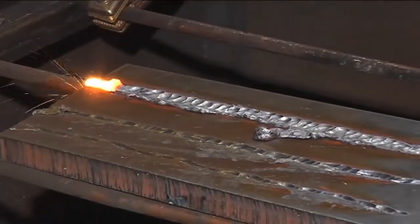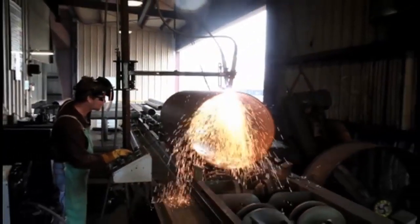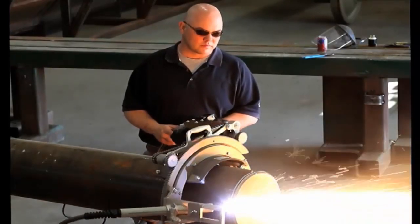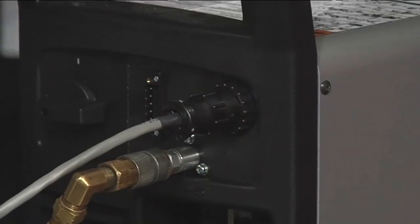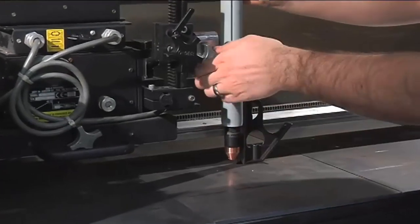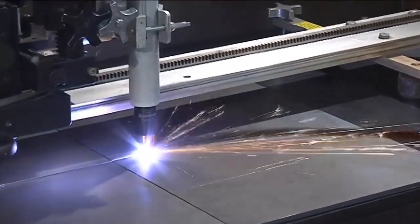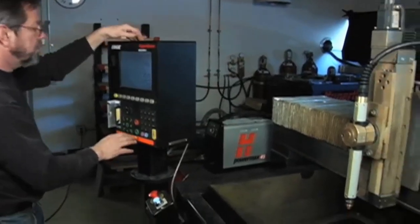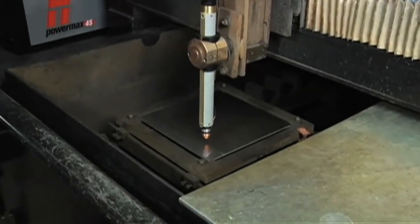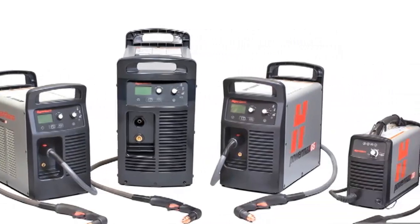The PowerMax 45, 65, 85, and 105 are compatible with a variety of automated solutions. Semi-automated systems, such as track and saddle-type pipe cutting and gouging systems, require that the on/off function of the plasma torch be done remotely. The Hypertherm remote on/off pendant connects to the CPC port on the back of the PowerMax 45, 65, 85, and 105 models. PowerMax torches are easy to install in universal mounting brackets on these devices. Setting up fully automated systems such as XY tables and three-dimensional robots involves setting up communication between the PowerMax power supply and a computer numerical controller (CNC) and a torch height controller (THC). Hypertherm offers different options and configurations for mechanized applications, with very robust systems and the lowest operating cost due to advancements in power supply, torch, and consumable technology.